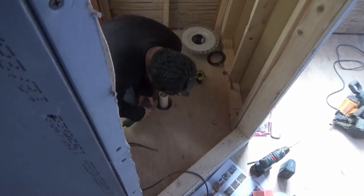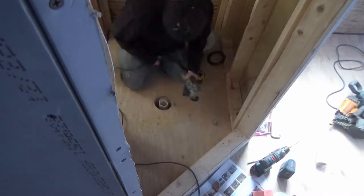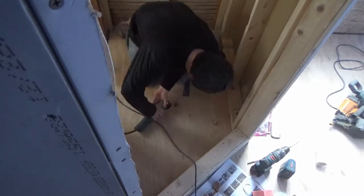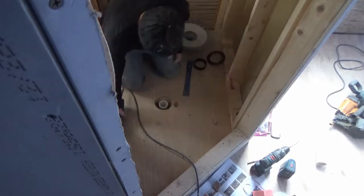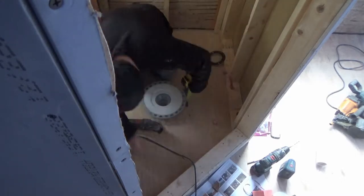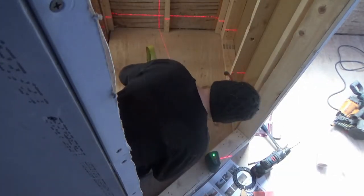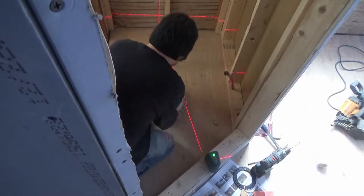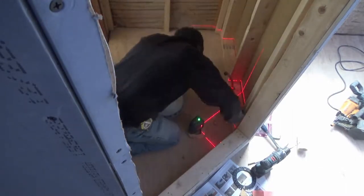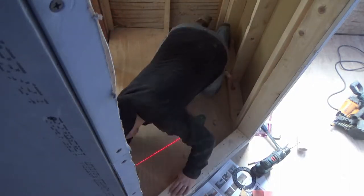This is after I framed the shower — I wish I had more detail, I'm missing some footage. This house has a lot of sagging over the years, so the walls are actually out about an inch on seven feet. I have tapered shims there and I have flattened everything — the original framing has all been flattened out. I chose to go over the lath because there's blown-in insulation behind it, so we left that and just flattened everything out. All these walls have been brought to plumb perfectly — within a sixty-fourth of an inch.